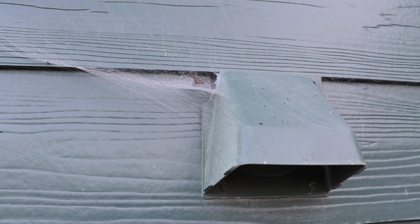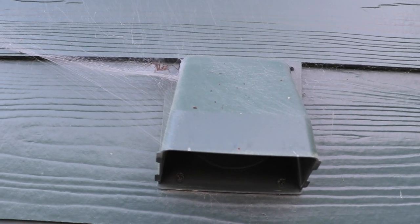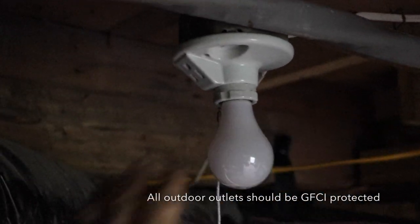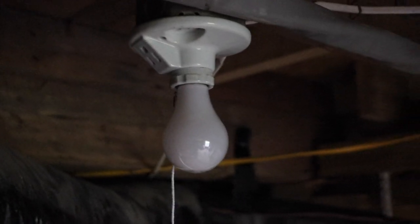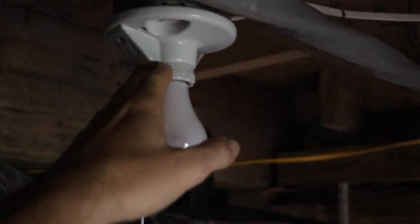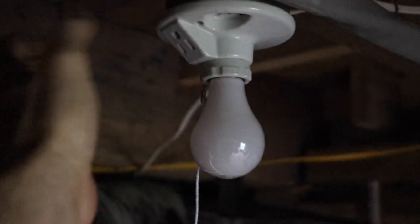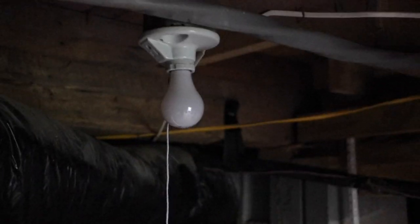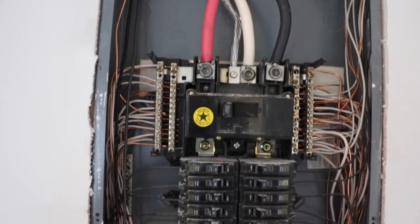Same company, non-electrical, but awesome workmanship. These lights are great to have. We have them all the way through our crawl space. This is not something the electrician did, but something the electrician was supposed to check. I've installed outlets on each of these so you can plug something in if you're working underneath the house. There should be a ground fault for that circuit. There's not.